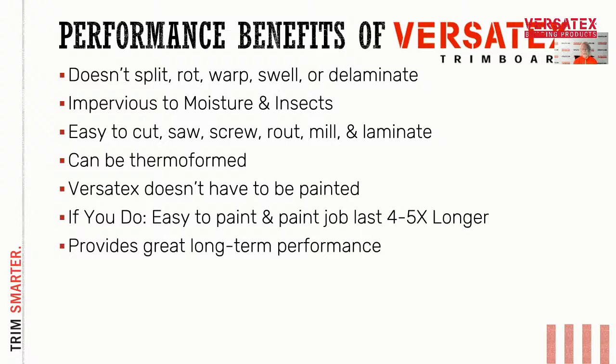All the jobs you saw that I was flashing in front of you a few minutes ago were painted. I was a believer in just doing a little bit more of an investment in painting the product. It just brought the thing together, brightened it up. And I know some think that if you're painting something, you're automatically creating a maintenance issue, but I don't look at it that way because it doesn't do like wood. If it was a paint job on wood, you're definitely creating a maintenance issue, but with PVC, it's going to last 4 or 5 times longer. It's not going to be the same issue. These people or your customers are just going to have to decide they want to change the color. It's almost the only reason they would have to repaint.